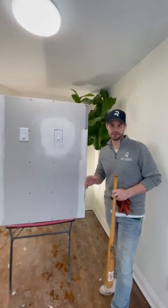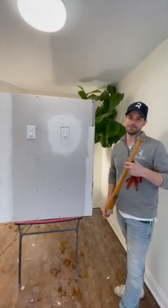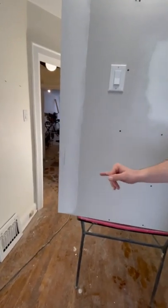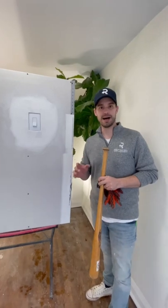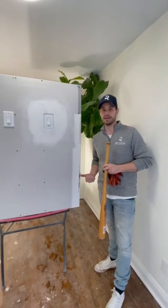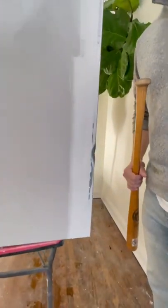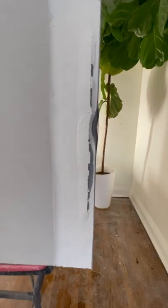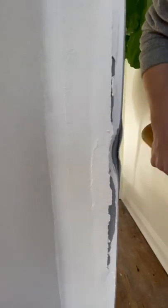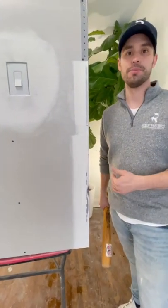My exit velocity on both hits were quite the same. But you can see the damage is very different on both the metal corner bead and the vinyl corner bead. Now let me show you exactly why the vinyl damage is going to be much easier to fix, and this metal damage is impossible — it's toast. If you come in nice and close, you'll see that the metal corner bead, right on the edge, actually indented completely. So when the bat struck the corner, you have a bat-sized dent in your corner bead.